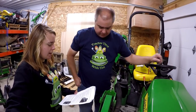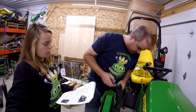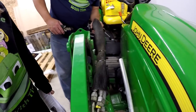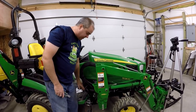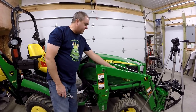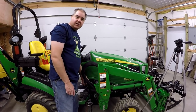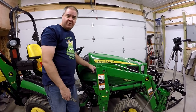Cut and remove cable ties at both ends of the protective webbing on the loader hoses. Okay. Before cutting, note the position of the ends of the protector. Okay, it's right there. Now before we get started with this, it would make logical sense to me to disconnect these hoses first. But I think maybe what's going on here is by disconnecting this end first, we might be able to hold those hoses up and that oil may go back into the reservoir and we won't have as much leaking. The instructions don't say to actually disconnect this down here until step seven.